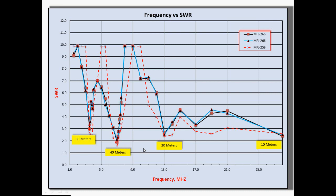What I want it for, it tells me this antenna is working pretty good, not especially great. I only use this antenna for receiving, not for transmitting. So an SWR below three is fine. That's a graphical representation of the test I did. The conclusion is it appears to be accurate and it does track the 259.